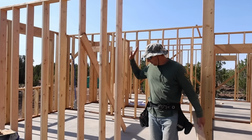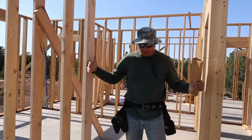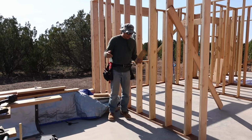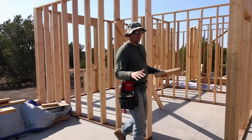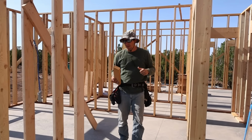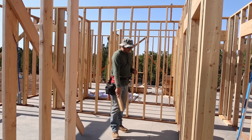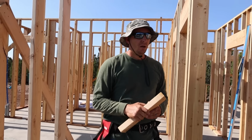Ourselves, this wall stood up, and you'll notice there's a little opening here, and there's a reason for that. So we're gonna have a second floor, and the stairs start right here. You go up the stairs, there's gonna be a platform, and then you turn and go up the rest of the way. So there's kind of a funny space right here that we're gonna turn into a closet. We're gonna have a wall come this way and then that way. And then that's gonna be it for a while on walls.